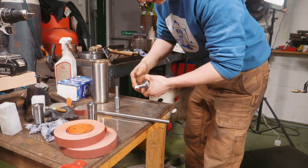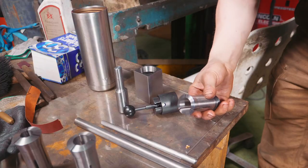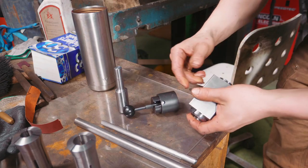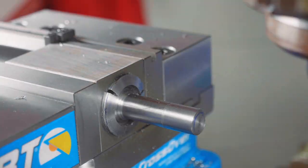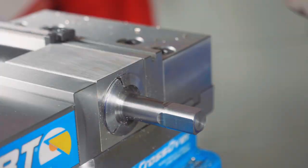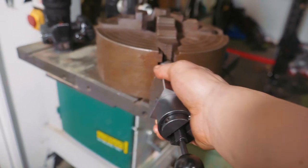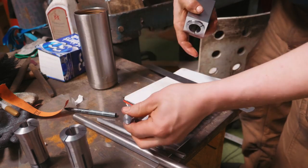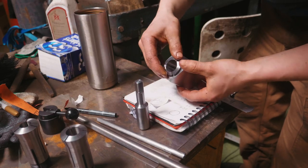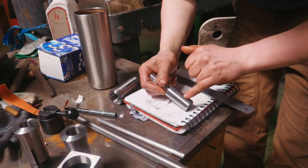So there we go — this can come out and we can pull this collet out. I can now take the 25 millimetre collet, throw that in, throw the other piece in. Let's see if it fits. Yeah, perfect! Now this collet block works perfectly for this application, but we still need to get a hole in it. I was just about to say we'd have to use a V block, but wait — I can't index the right orientation with the collet block because I can't tell where my square is to index to it.